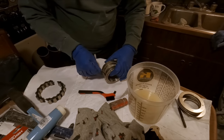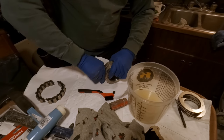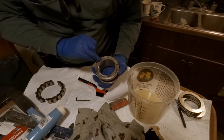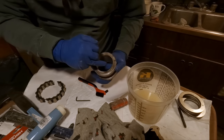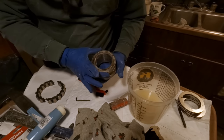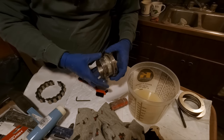This grease was gnarly — hard, like a preservative type stuff. Now that we have these loosened up, there is a stamping on the inner races to match the sides together. You need to put them back in the same orientation because of the way they're fit up and ground — that ensures they're nice and smooth where they meet. The same is true with the outer rings. We want to make sure we put the stampings all back the same way so they tighten up properly.